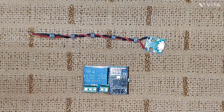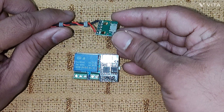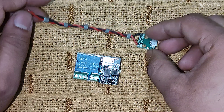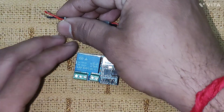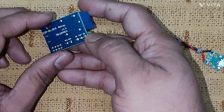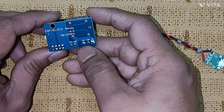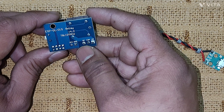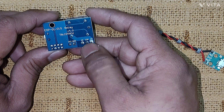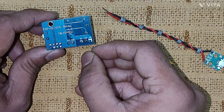These are the devices. This is a breakout board — the USB is over there. I connected two wires to get power from the USB and directly connected it to the module: plus and minus five volts. On the module you see VCC is 5 volt, ground is ground, and NC, COM, and NO — which means normally closed, common, and normally open.